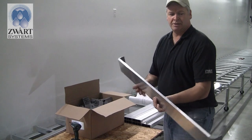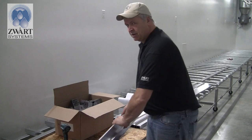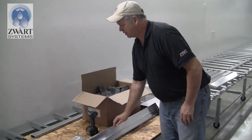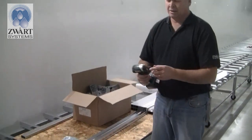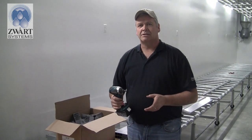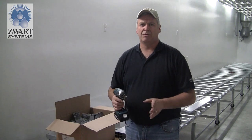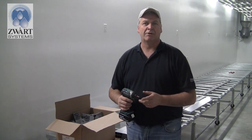With the corners on, we're 48 inches completely wide. One thing to remember: use magnetic tips on your driver when doing a project like this with tek screws — a magnetic tip is far more convenient than cheaper non-magnetic ones.